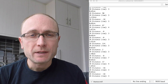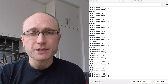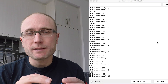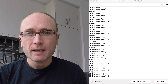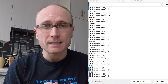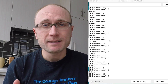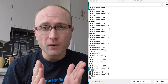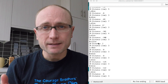I really struggled with the sensor problem because I was relying on the Arduino library, which is supposed to simplify things. What I found was that where the library tries to average the values and give you a more reliable reading, it was actually causing confusion. When I looked at the raw data coming directly from the sensor, the values were actually pretty consistent. I modified Rover's code to use the raw high-low value from the sensor rather than the averaged library value, and that solved the problem.